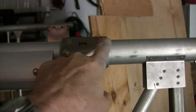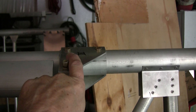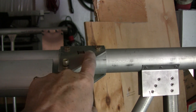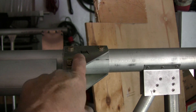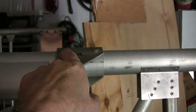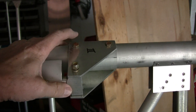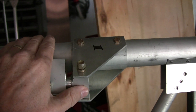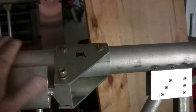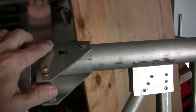The holes in the spars are pre-drilled. You may have to use a reamer to bring them out to size for a bearing fit, like I did, but that's alright because I want a nice clean bearing fit on these. You insert the bolts through. In this case here I have the heads of the bolts — this is the aft end or the rear spar — and as you can see I'm going to have an aileron coming along here so I've got plenty of clearance.